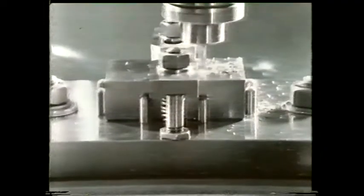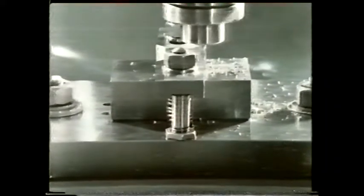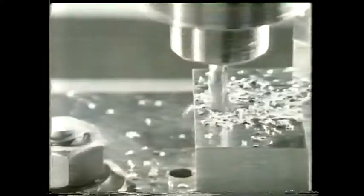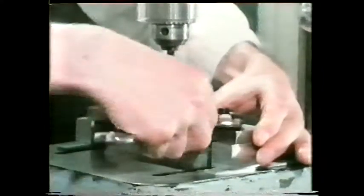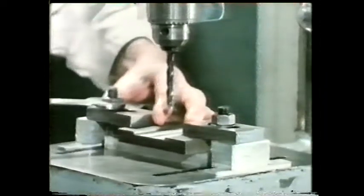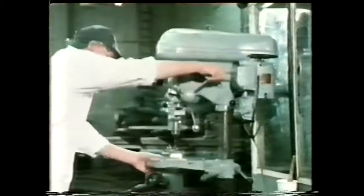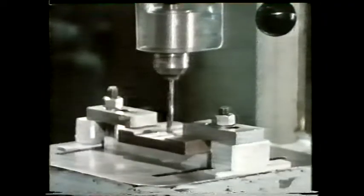The forces are so small that the metal dowels aren't really necessary. In two directions, we're relying on a frictional restraint obtained from clamping forces. When machining, clamps are often used for work-holding purposes. In this case, it's a component on a drilling machine. By clamping the work to the table, we've prevented it from moving up and down. To prevent the work from spinning round, there's only the frictional restraint resulting from the clamping forces.